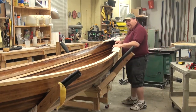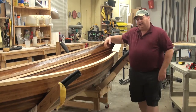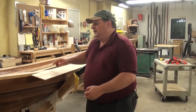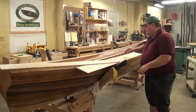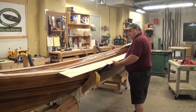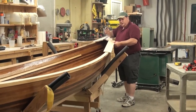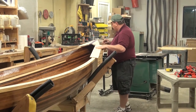Let's get started. You're going to have to lay out some pieces. I lay out my first piece, take my second piece and lay it out here making sure it completely covers the gunnel, and then take the smaller piece and lay it out at the end. By doing that I know these three pieces will completely cap my gunnel. I chose to start up here by the breast hook, and like many other things we've done, that's going to require some scribing.